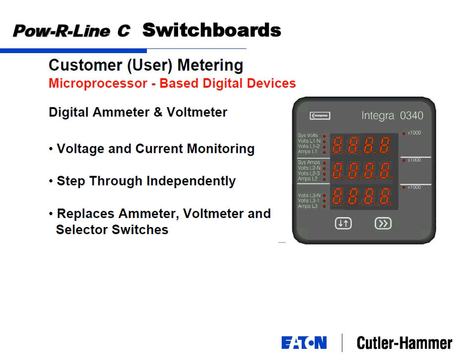And I got just a couple of meter pictures, but I think the main point is you can get customer meters in a wide variety of flavors now. You can get vanilla, which is ammeter and voltmeter. Maybe that's all you need. Below vanilla, what is pretty much obsolete is analog. There's a couple of guys around town who'll still use analog because by God, that's the way they've done it, and that's the way they'll always do it. But basically, analog meters are just going by the wayside for a normal amp volt application. Digital customer metering is much lower cost than it used to be and much more flexible and easier to use.